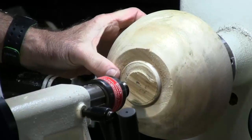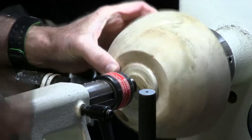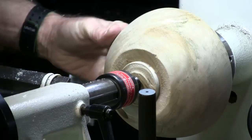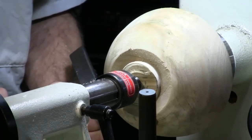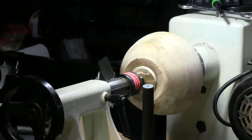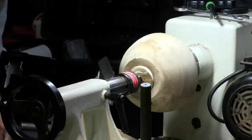We're going to pretend this is at least six weeks and hope it doesn't move too much when I'm through. I left the mark — you don't ever take the mark off the bottom when you're rough turning it. That allows me to get that live center right back into that center point. I'm going to double-check the tenon size to make sure I didn't get it too small. I haven't needed to tweak it much.